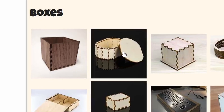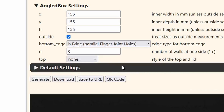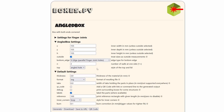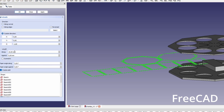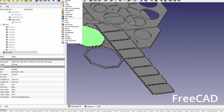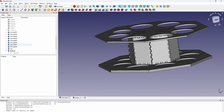I chose the angled box and it takes me into a form where I can set the sizes of the box. For this design I need 155x155x155 and we're going to need 8 walls so I need to fill in 3 here. For the top we choose an angled hole and after this we can adjust the laser cutting tolerances. I hit generate and there we are! These parts can be exported to a file and I open this in FreeCAD and extrude the parts. We only need to rotate some parts and then we have the 3D assembly. I laser cut the panels, added the electronics, and made some software.